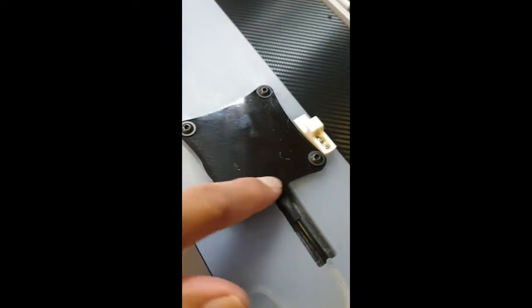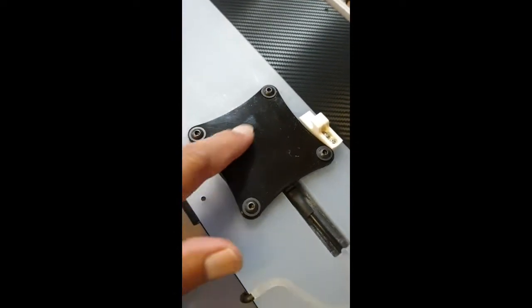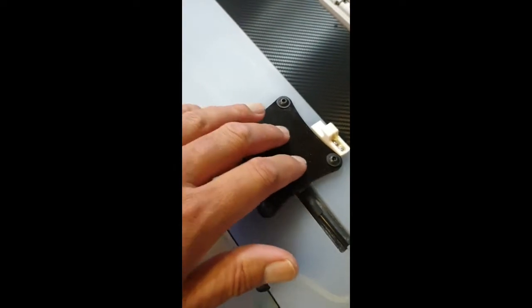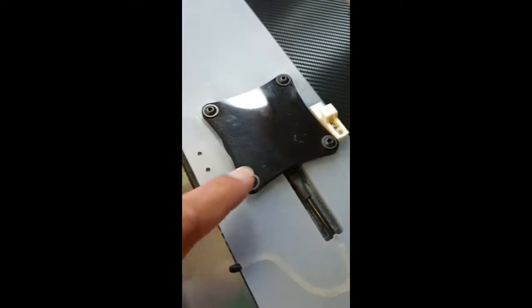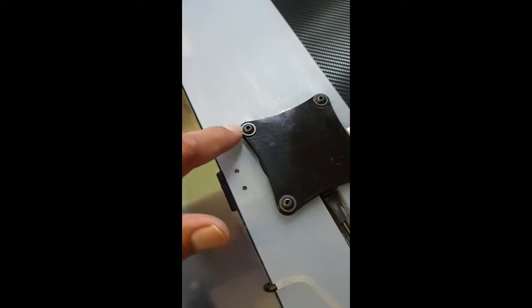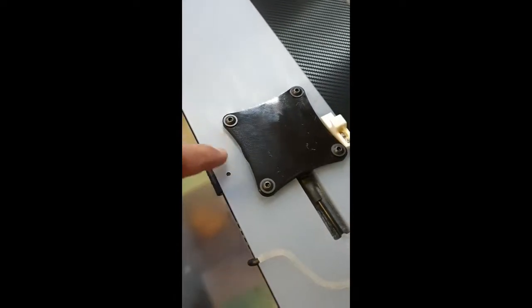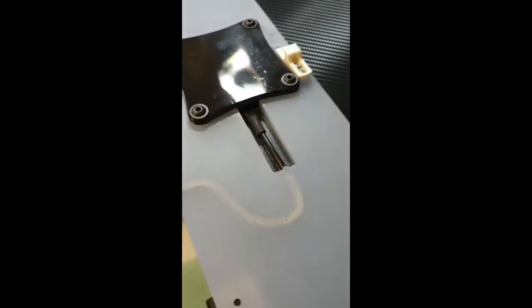I could have machined it, but I used the 3D printer. So I've created a 3D printed plate there, which is double-sided. The wireless charger is double-sided onto that. That's then secured in with M5 bolts, and in the lid, I've got my usual brass inserts in there. I quite like those in the plastic. And then that's the lead that I created.